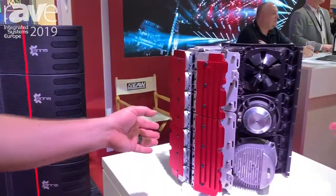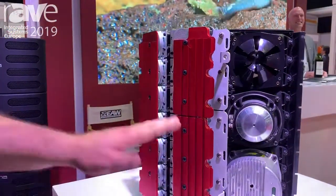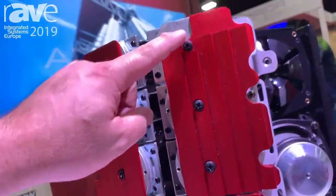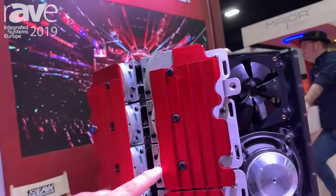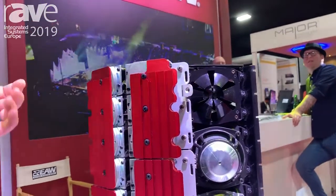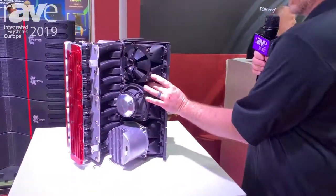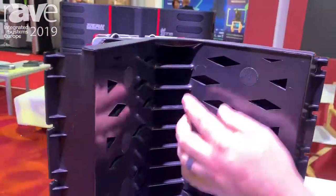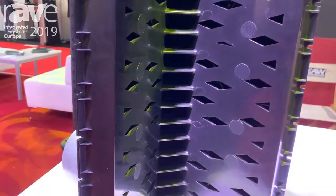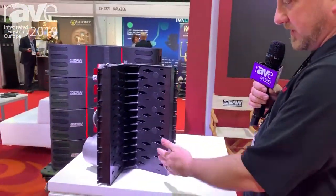I'm going to come in here and show this. So this is our HF section — actually the HF section of her bigger sister Anya, so there's a few more drivers in this one than that one. Basically HF, HF as we go down through here. Each one of these guys is on a one-inch center to the other, which is line array math to get it as tightly spaced as it can be, giving us an exit of everything is one inch. Every one of these cells HF-wise is controllable by an individual DSP channel, so I can manipulate this into any shape of coverage I need to.